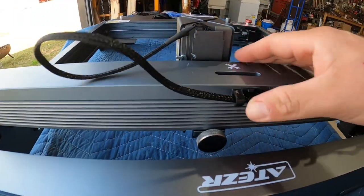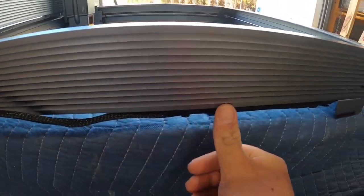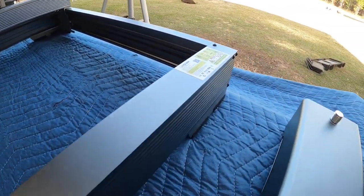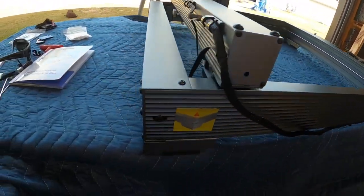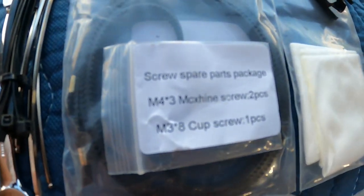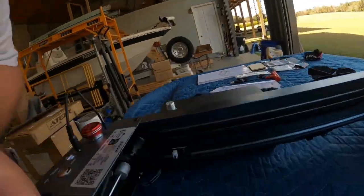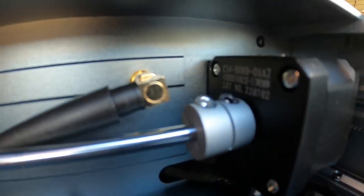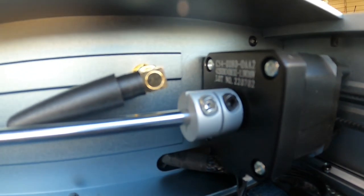Cable management — another gripe I've had with some lasers in the past. This one came with simple stick-on cable management tools, and I really like how it keeps everything nice and out of the way. There's the 20 watt head. Looking down the unit, this is the control board where you plug in all your cables, your emergency stop, and here's your belt tension on the end — very easy to get to. Spare parts are included: extra screws and extra belt. I'm glad it came with that screw, because I needed it for the locking collar on that shaft. Luckily the package came with spare parts.